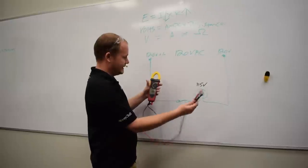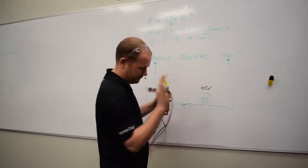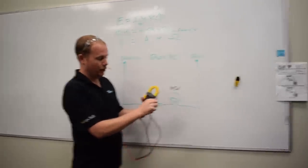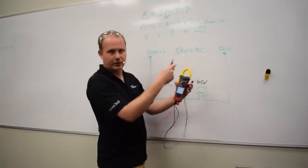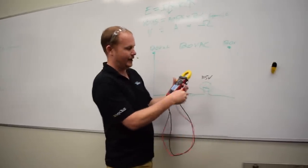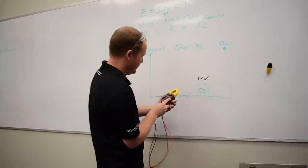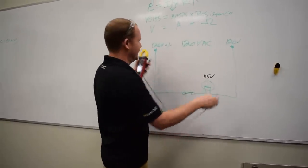Now, let's say I take my voltage drop measurement device, my voltmeter here. Now, the first thing, quickly, and I say this all the time, but for those of you who are newer, before you use a meter, always put it on ohm scale and ohm between your leads to make sure that you have a path through your leads. I hate it when guys are like, I don't have any voltage, and it's just that one of these jacks is a little bit out, but when you do the ohm test, you can see that that's the problem. Okay, first tip. So now, we're using this voltmeter, and now it is a voltage drop detecting device.